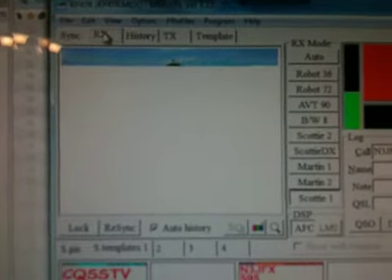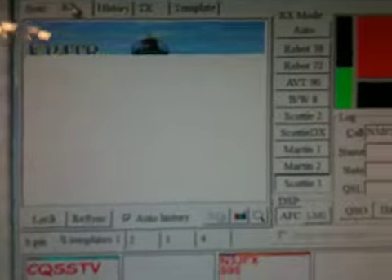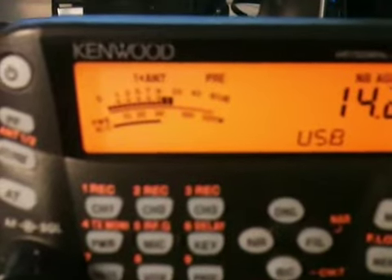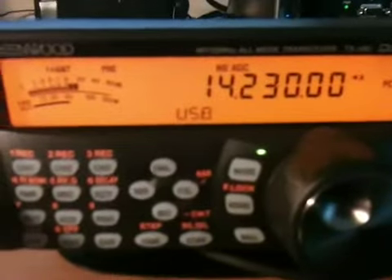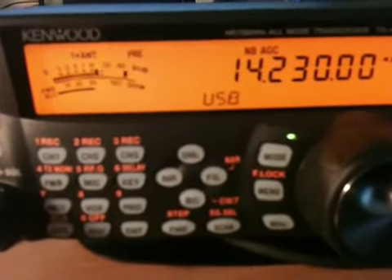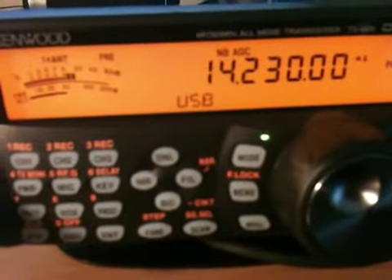There's a little problem — I've got two images coming in. Let's see if this image comes in okay. There's a perfect signal coming from what I think is N3JFX — pretty loud signal. Remember, all the audio and all the control is actually being done over the internet. My transmitter is actually six miles away. I have a Cushcraft X7 at the other end at about 50 feet on a tower, and the physical radio plus another RigBlaster on the other end.